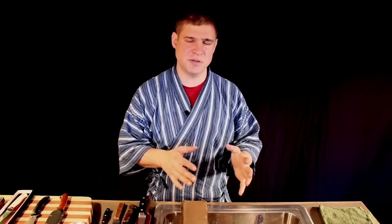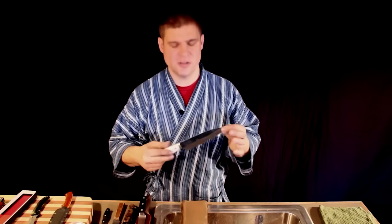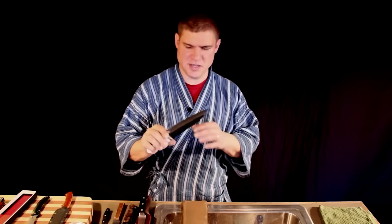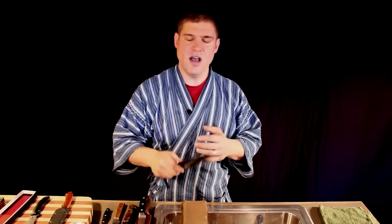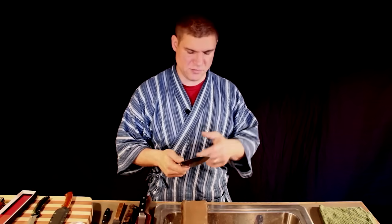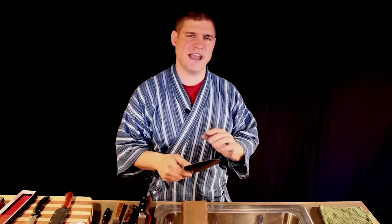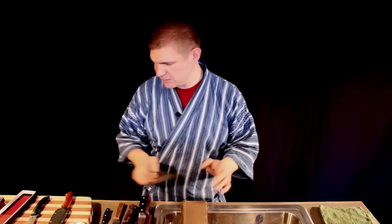Steak knives, you know, if you're determined to eat your steak on ceramic plates, clearly ceramic is many times harder than the steel in a knife. And so it doesn't matter, your top quality $700 Carter laminated kitchen knife isn't going to hold up against being cut on a ceramic plate. Doesn't matter that I use a white steel core #1 in there with 1.4% carbon and 64 Rockwell. Ceramic is way harder than that, and this edge on this knife will be trashed the first time it even comes in contact with ceramic.